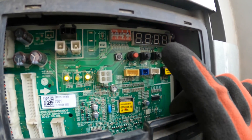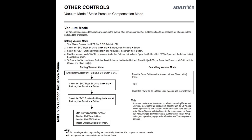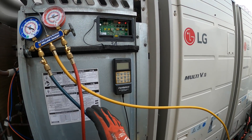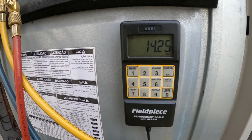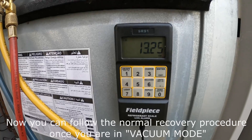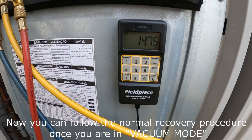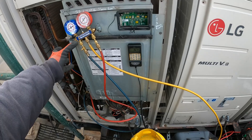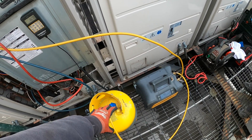I'm also going to show you a picture of the instructions from the manual on how to do this. Now that we're in vacuum mode, basically the entire system — all the indoor units, the outdoor unit, the HR boxes, everything — is open. As you can see, the refrigerant levels are rising on the scale. We're going to let this machine do the job — it's pulling the refrigerant out of the machine through the recovery machine and into our tank.